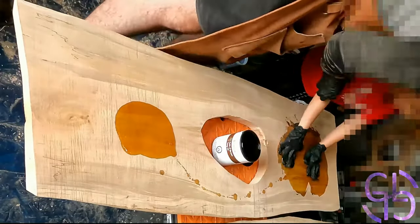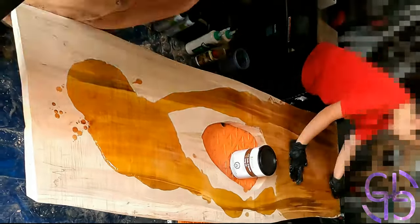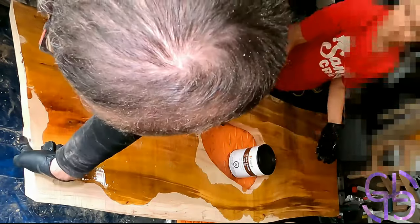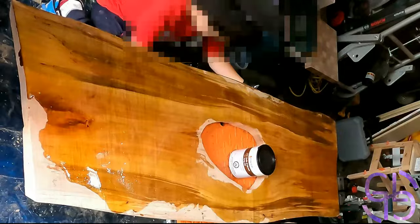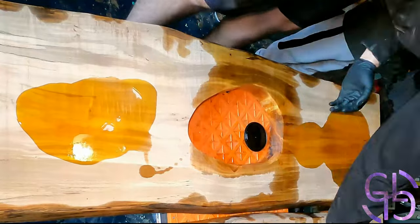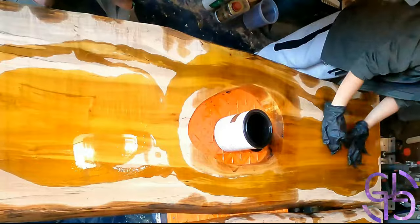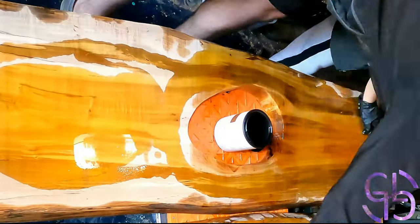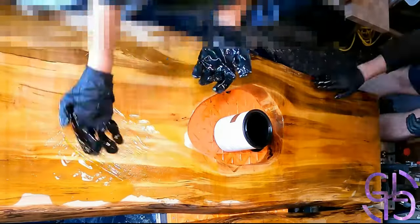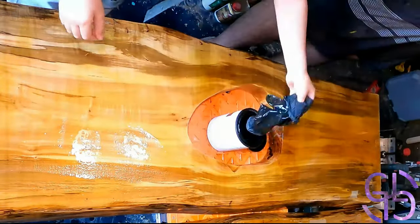Now that sanding was done, we doused the whole slab in tung oil. 2 liters total of tung oil was used throughout 9 weeks of drying. You can kind of see me oiling my own slab for the table beside it — my son worked on his slab while I worked on mine. This one we dried a lot longer and gave it a lot more oil since it was very, very thirsty. The tung oil did an amazing job of driving the remaining insects out. You can see me catching some of them so I can release them outside. Unlike my piece, this one was chock full of life thanks to various holes it had, so the number of bark centipedes and wood lice was triple that of my slab.